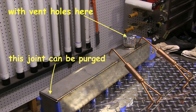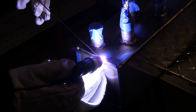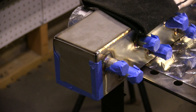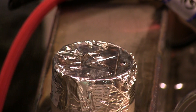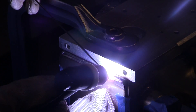I've got these copper third hands on here to transfer a ground, and I've got a vent hole cut in the aluminum tape at the high point so that joint can be welded and purged. On this different joint, I've got holes poked in the tape of each one of those nipples because they are now the high point where oxygen could be trapped. With a hole poked in there, it allows the argon to displace all the air out, just like the water demonstration. When purging a part like this with little protrusions like nipples, you've got to be mindful when you reposition the part where your high points are — always have a vent at the high point. I like to use a little x-slot a lot of times because it prevents a weld blowout when you seal everything up. When you make that last weld, you see it open up just a little bit — it stays shut while you're welding, and when you close up the weld it'll open up and save you some heartache.